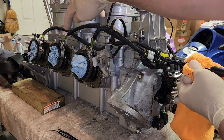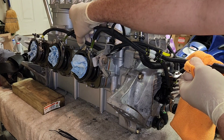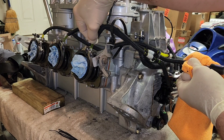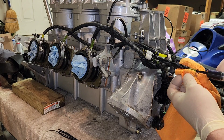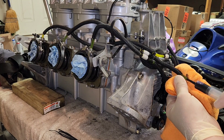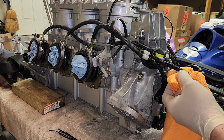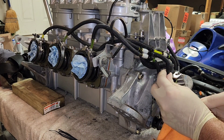Watch it — it's going to fill it. It just finished up right here. You can see down there the last one I haven't done yet — that one is still yellow while this one has the blue tint. I did this one first, this one second, and now the middle cylinder is full. In order to keep from having too much of an air bubble, you can just fill the last little bit out to the end. Just make sure you don't overdo it, but it cuts down the air bubble at the very end when you start the ski up.